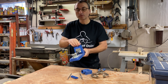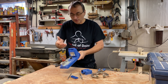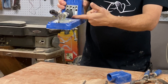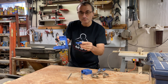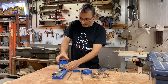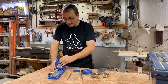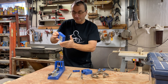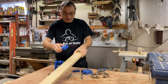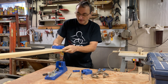So when you are using it in a spot where you can't use the whole jig, it's typically going to be three-quarter inch wood in most cases — not all. If not, you do have to do something a little bit different and get a different spacer. You can see that space right there is the thickness of this spacer block that happened to come with my kit, and you can get different thicknesses of these. When you put your wood in here, the wood is flat against this base and you drill your hole. Once you take this out, you've lost that reference point — that space. So if you were putting it up against a piece of wood like this and put it right to the edge, you're going to drill too deep.